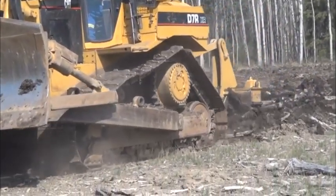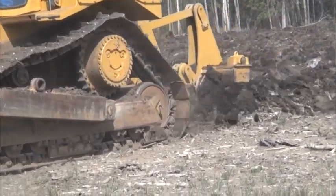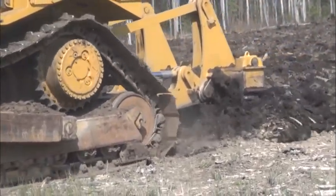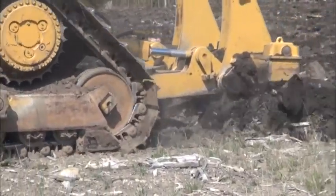The rip plow has the capability of plowing across a wide range of soil moisture conditions. When the moisture conditions are wetter, rip plows produce bigger clods because it is more difficult to break moist soil into small pieces.